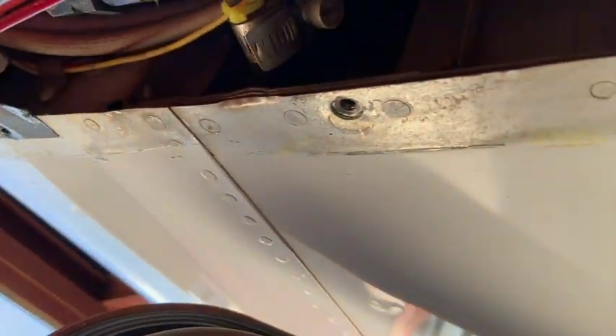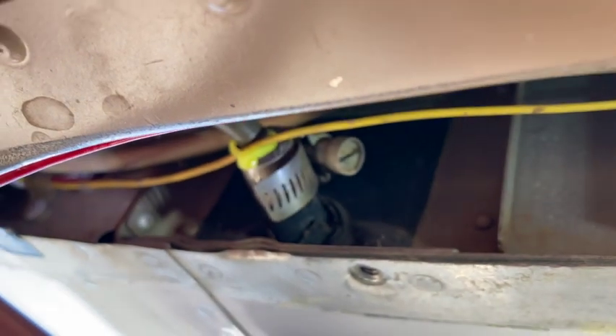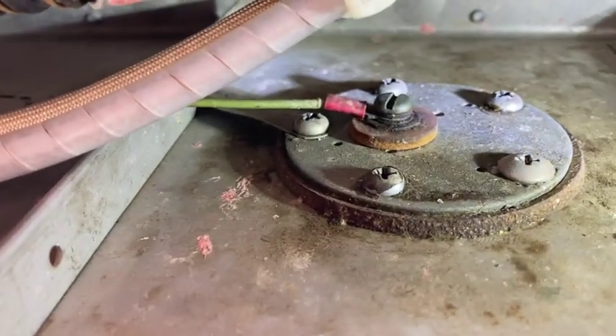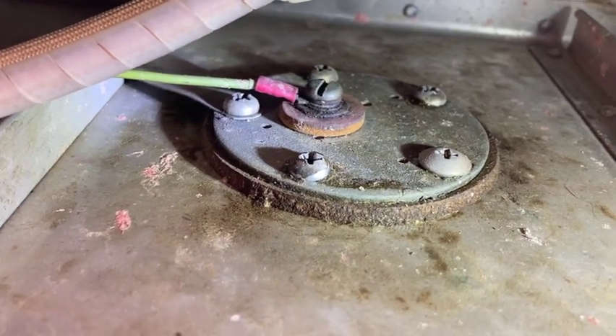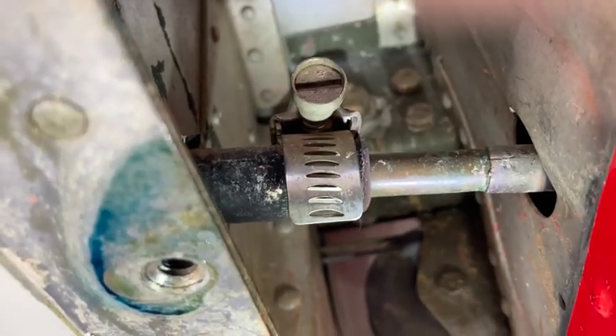Up in the wing here — this is the forward edge of the tank on the inboard side, and there's the bulkhead. There is the fuel sensor installation in the tank — that's all got to come out. The green line is probably the ground wire, and at the back is the other fuel connection. Cessna tried to do some things to make these tanks feed the same.